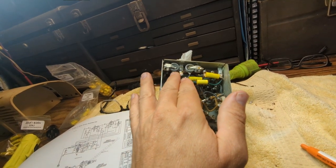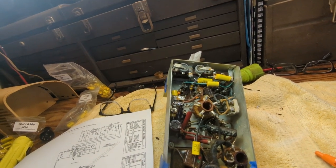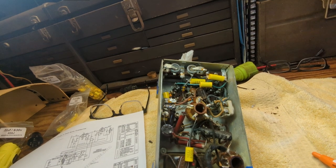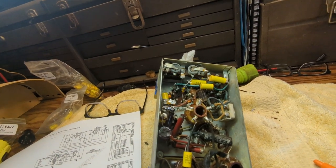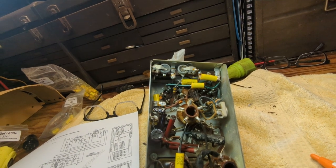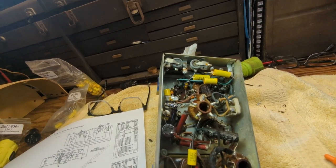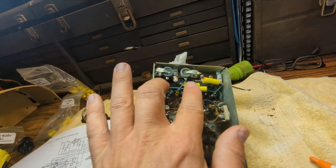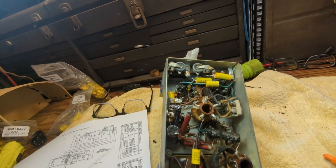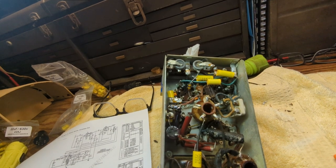These are actually batteries. They are carbon zinc batteries, and the schematic doesn't really say what the voltage is, but it doesn't really matter what the voltage is. What they do is they put a charge on both plates of the mic, and the microphone is a condenser mic. Condenser is an old-fashioned word for capacitor, because that's what it's acting like. You have two plates of the microphone, and these guys put a little charge on those two plates. I'm not an engineer, and I'm not sure how this works, but essentially it doesn't really drain the batteries. The batteries essentially have no load at all.